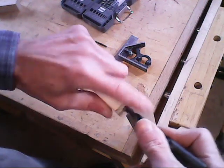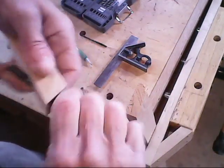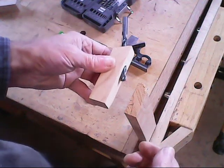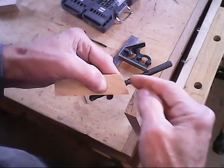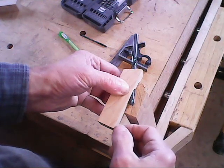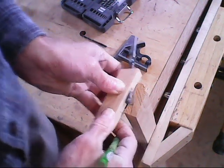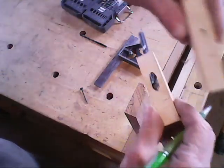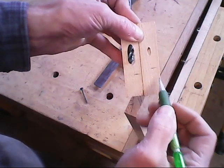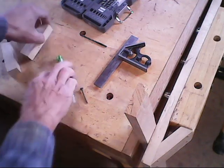So I'm going to put it on my next block, put the drill through here, and bring it down until it lines up with that line — I have to adjust this drill bit now until it lines up about right there. So now when I put this block on the workpiece, I have my drill bit. I'll have to put a piece of tape here when I go to do the actual process. I bring my block down, in line with this line. I'll mark this block where this drill bit stops right here. These two lines are very important — this line on this block and this line on this block are very close to the same place, but this one is down a little bit farther.